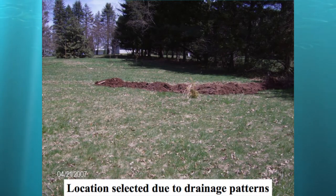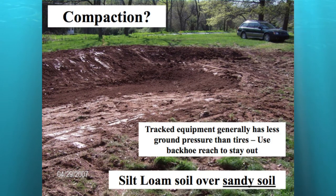This is the first rain garden I built at my house. There's no overflow other than the spillway, which is right at the property line — I didn't want water overflowing onto my neighbor's property. After digging it out using the dig-and-drop method — digging from the front and dropping soils to make the berm — the spillway allows water to flow down to the road and to an inlet. The soils were very loamy — a combination of silts, clays, and some sand.